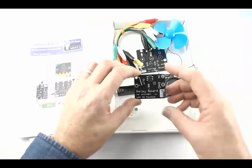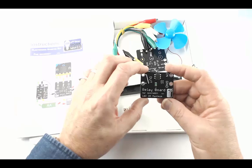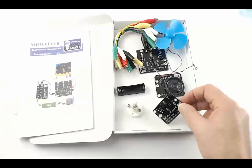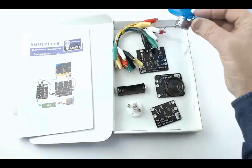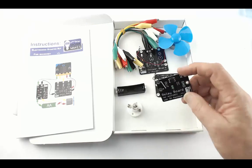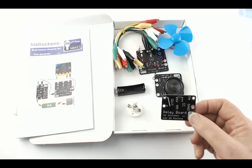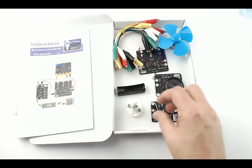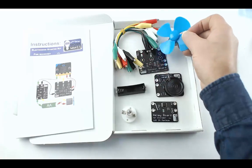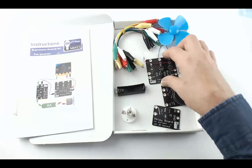You can't use it to turn high voltage things on and off — it's got a maximum voltage of 16 volts and a maximum current of 2 amps — but for turning things like light bulbs or motors on and off that's absolutely fine. Because it's a solid state relay rather than an electromechanical one, you can actually use it to control the amount of power going to something, so you can control the brightness of the light bulb or how fast the motor turns.